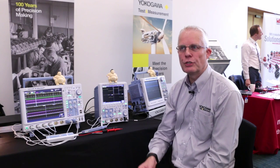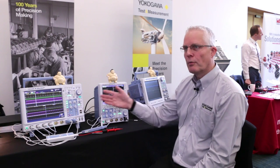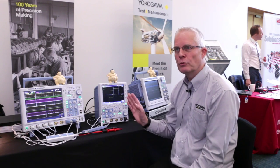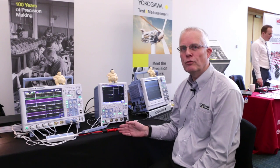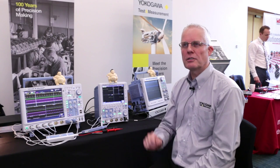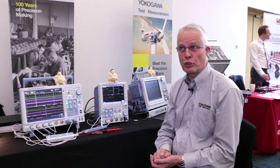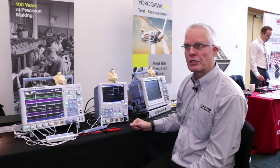For a lot of electromechanical applications the vertical resolution is quite key. These are both nominally 8-bit digitizers, but when you work to a slower time-based speed you can put them into a different acquisition mode where they acquire up to 13 bits vertical resolution. Then the question comes — it's very nice to have it, but how do we display 13 bits of resolution on the screen? What we have here today is very simple — we're looking at the calibration signal.